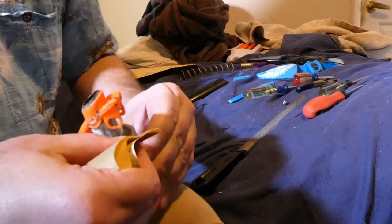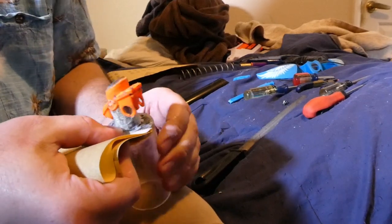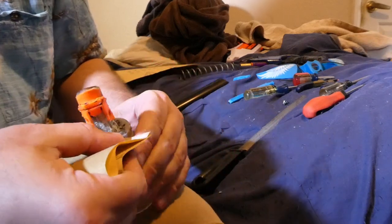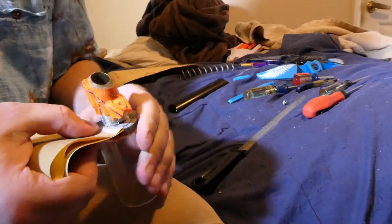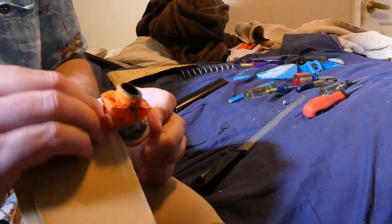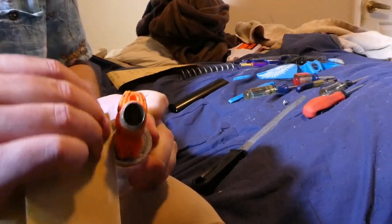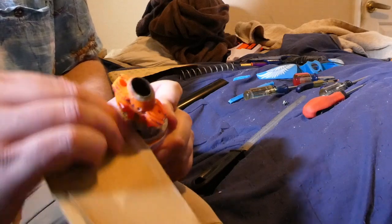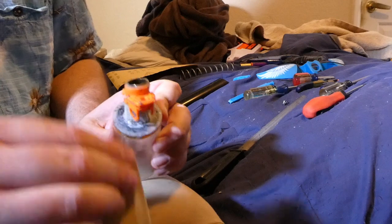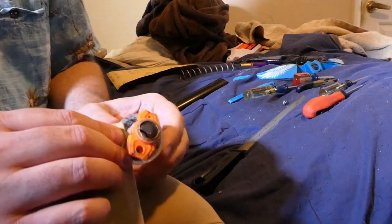And when you want something that's perfectly stable, yeah, that's right. And you can tell that a lot of that was caused by my filing. Okay, but what the sandpaper does, and I might have been better off going up with 180, 220 will take me longer, but it will now even this up, so when I put the layer of fiberglass on this, it's going to be really cool. Yeah. I know, a lot of work, but this is what it takes.